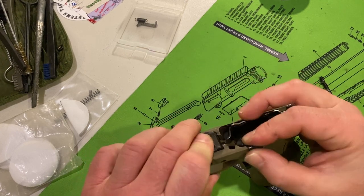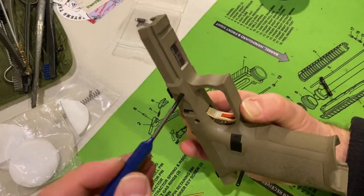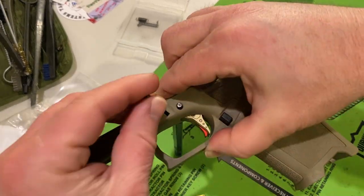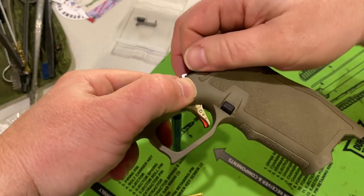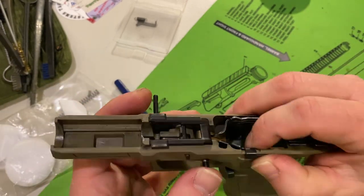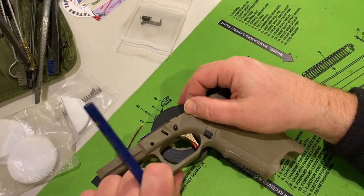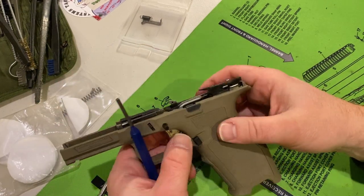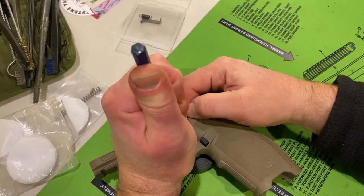As the locking block goes in, it gets a little hard to line up with that spring that comes off the slide stop assembly. So again, you just need a punch or something to guide those holes together. As you put in the trigger pin — in other videos people say just move around the slide stop assembly lever and everything should fall into place — that has happened for me before, but this time it needed a little extra nudging. I had to get on my armorer's block and just force down on it with one of the punches. It fell right into place though. Here you can see me moving the slide stop lever and then it just punches right in.